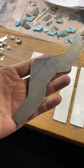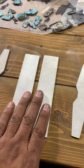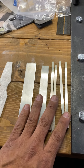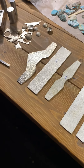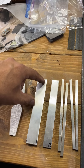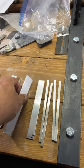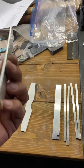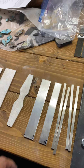I wanted to explain the difference — that's why I did casting demos today: going from tufa casted, to sand casted, to lost wax casted. I'll talk more about this later and show the mold process. You can also do an ingot — carve a channel in a tufa, cast it rough, then hammer it flat and roll it through a rolling mill to produce your base sheet. That's ingot jewelry and it's very labor intensive.